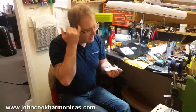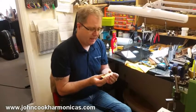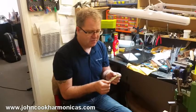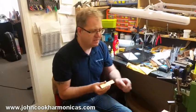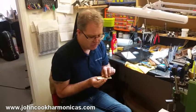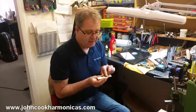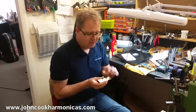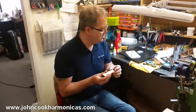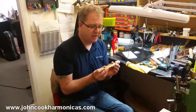But one of the reeds that they made is a reed called a Dix, and it's very expensive. It's one of their most expensive reeds. And what they do is they get a phenomenal tolerance on the gap. And I asked them, how do you get that gap? Do you burnish them and emboss the slot? And they said what they do is they use a technique, a chisel technique.